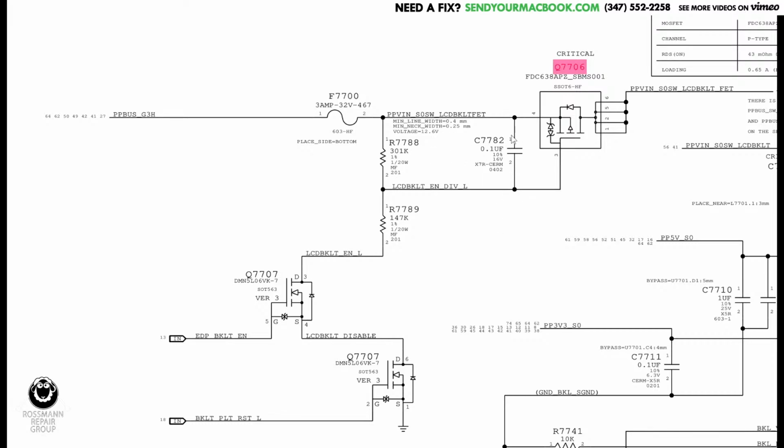You understand? Because this cap is running in parallel with this resistor. So it's not going to be 301 kilo ohms of resistance between here and here. It's going to be 0, because this is now a wire. That's not a voltage divider circuit. You can't have a wire at the top of your voltage divider. It doesn't make sense. It doesn't work. Because this is going to have the ability to send so much current through to here that even if you're sending a little bit of it to ground with this pathetic little 147 kilo ohm resistor, it's not going to send enough to ground to actually lower the voltage, because you have a wire from here to here.